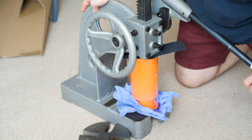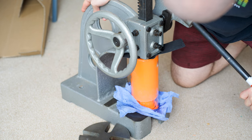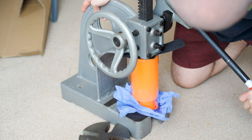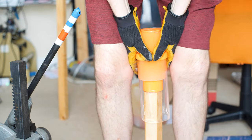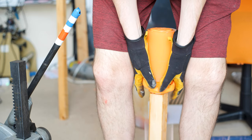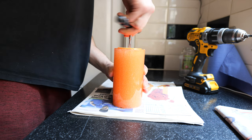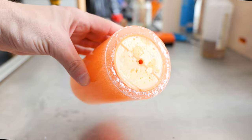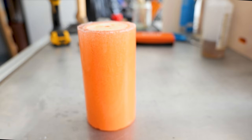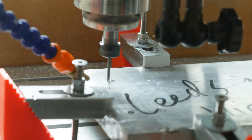I'm not sure if my mould release just isn't good enough, but this was a real struggle — about half an hour of trying to get it off. We did finally get it off, chopped off the end, and now it was time to put some threads in it. This one has come out much, much better. The core is also thicker so I'm not using as much rubber — just 12mm of rubber each side, which is really all you need.